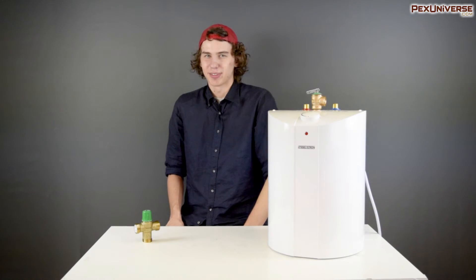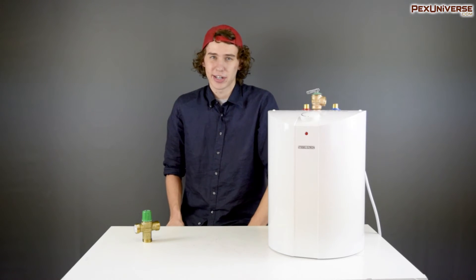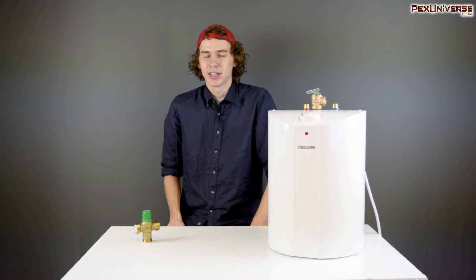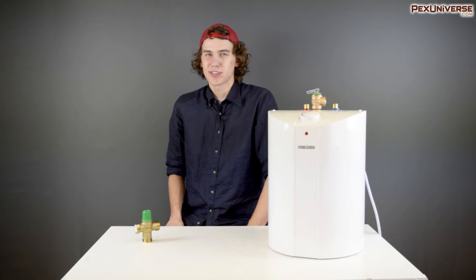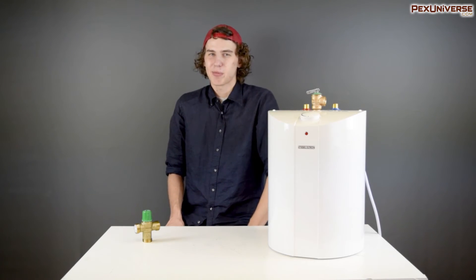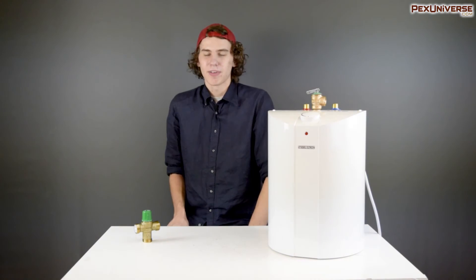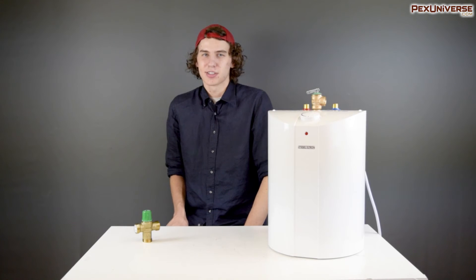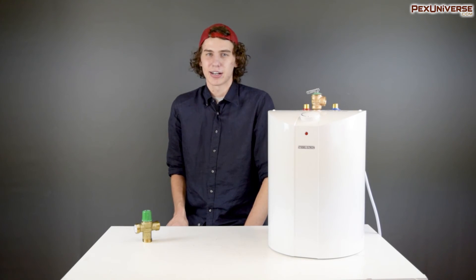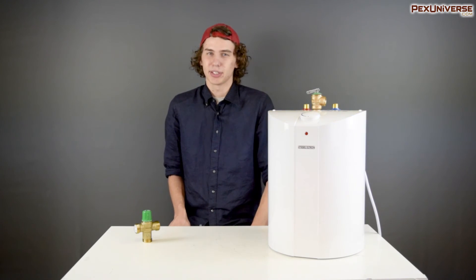That's not the end of the story, however. The same journal says that in some applications, when specifically using gas water heaters, it may be more recommended to use the lower 120 Fahrenheit standard. This is because the risk of scalding with these devices can be somewhat higher. We leave it up to the consumer to make an informed decision on this one. Finally, in large-scale applications specifically, such as apartment buildings, it is always recommended to use 140 Fahrenheit. This is because the risk for pathogenic bacteria is much higher, as the distances between points of use can be increased, as well as the possibility of dead legs.